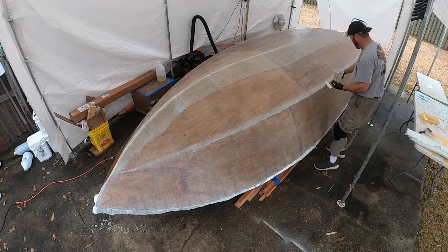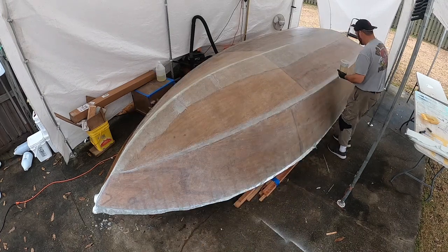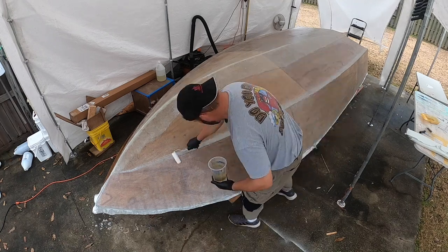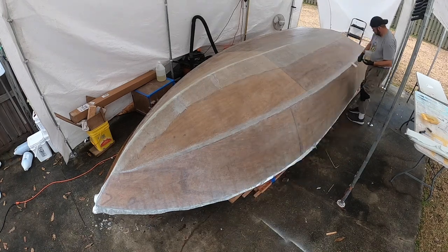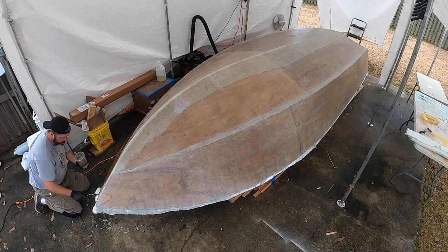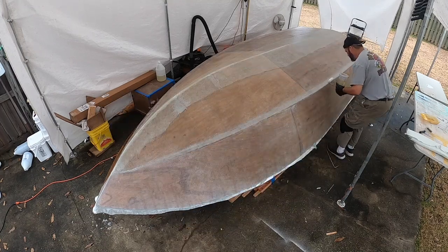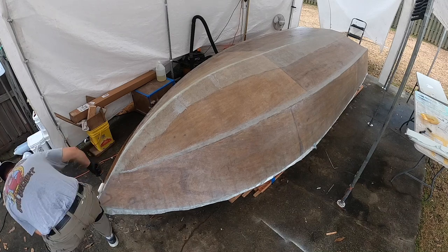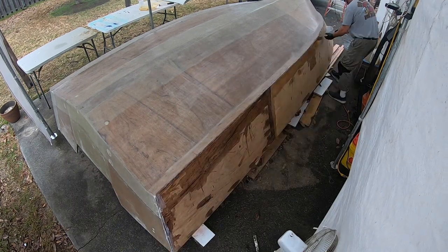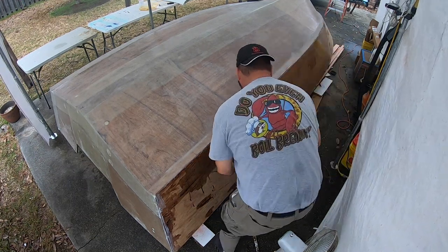Just going back to roll it out. I worked on these chines and I'll come back and hit them again after I finish the other side - I'm really trying to make sure that stuff lays down. As that epoxy starts to get tacky, it does help. What worked best in the end was the little yellow spreader - I could put it on an angle from the top to push the epoxy to the edge, then get on the other side and angle it again to lay that stuff back in. It's hard to describe but I hope to show it better during fairing.